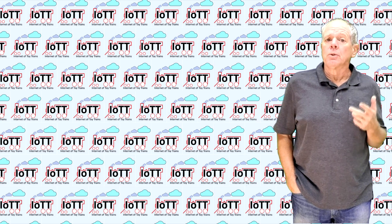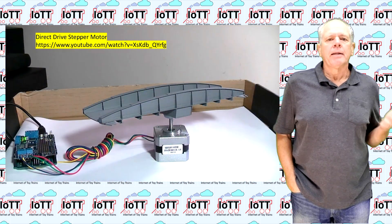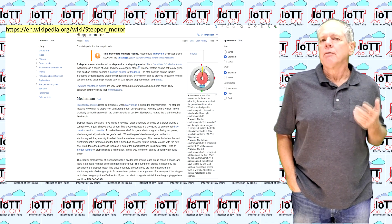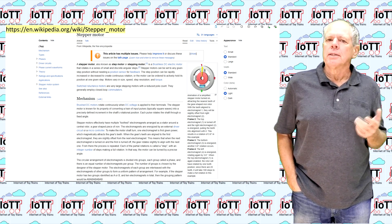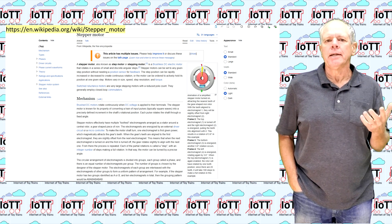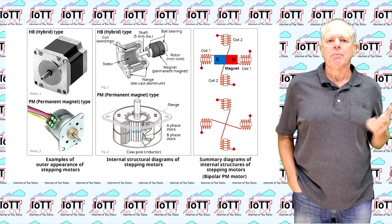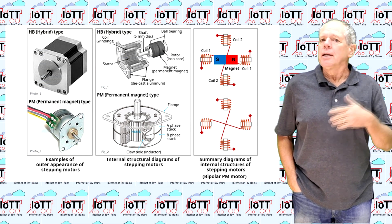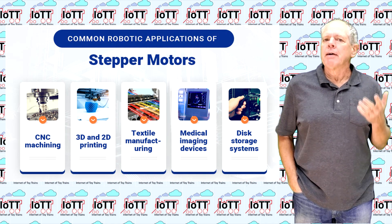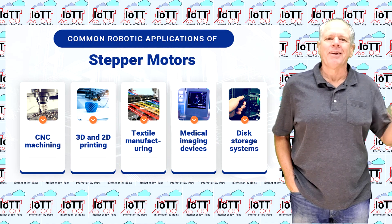The most common method to drive the turntable, it seems after some research, is using a stepper motor. There are several do-it-yourself videos available showing how to do that. A stepper motor is basically a brushless motor with two magnetic poles in the stator and a rotor that looks a little bit like a cogwheel. The stator coils are polarized sequentially and with each change of polarization, the rotor advances one step. Typical stepper motors therefore have a set number of steps per revolution, either 200 or 400. With these characteristics, stepper motors are widely used in applications where precise motor control is needed, for example for 3D printers, robot arms, or model railroad turntables.